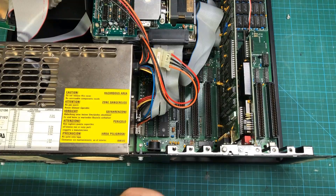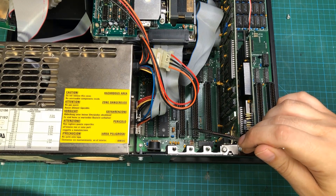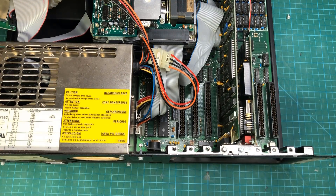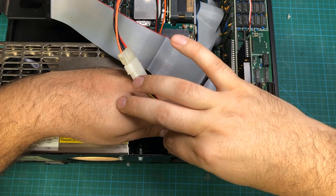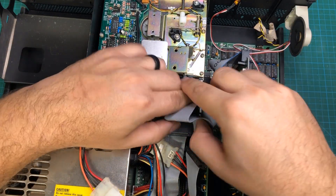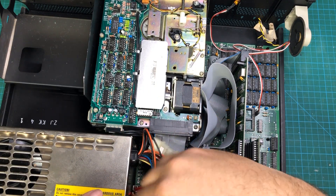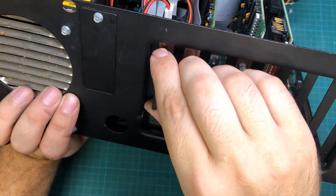This board is legit. One of the machines that makes this style of XT IDE ideal is that the slot right here is called slot 8, and it does not work with most expansion cards. You can configure the XT IDE to work on this slot, but it requires changes that could make it not work with other machines. So rather than do that, I'm just going to cover that slot with the compact flash card and controller here. I've already connected the power, so I'll put this down and use one of those original screws to mount the card, making sure the IDE port faces the back. Cable management was a lot trickier back in the day and I'm not going to worry too much about that right now. I'll just tuck the cable down out of the way, make sure it clears the top of the case, and give the whole thing a test.